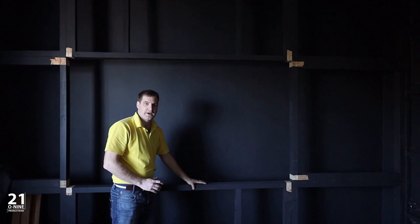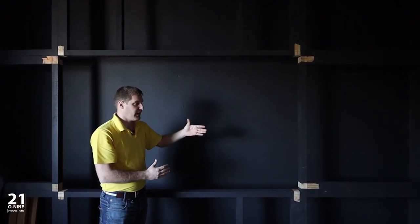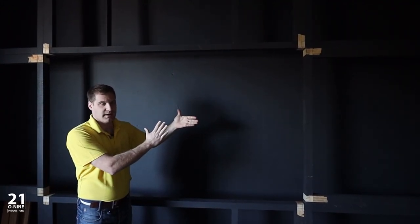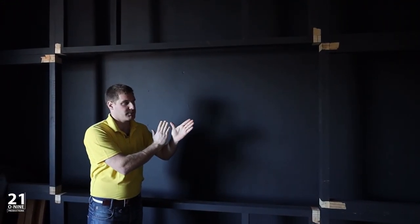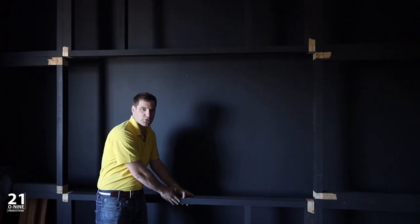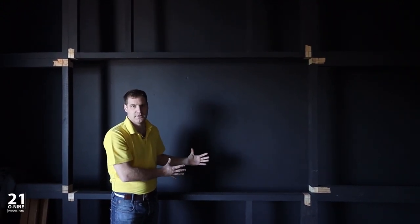Onto the back of this framing, we're going to mount a timber board, which will be wrapped in the same screen fabric as the rest of the front wall, and our TV will be mounted onto that. That'll give us the illusion that the TV is floating in front of the backing panel, and with some luck and good measurements, the front of the TV screen will actually be finished up flush with the front of the acoustic panels that we're going to be mounting either side of the screen wall. So onto this solid framing, we've made sure that everything is strong enough to house the TV, speakers, and any acoustic treatment that we require behind the screen.